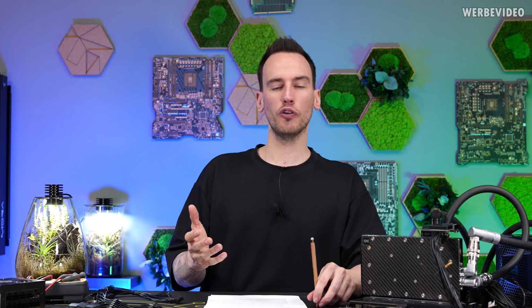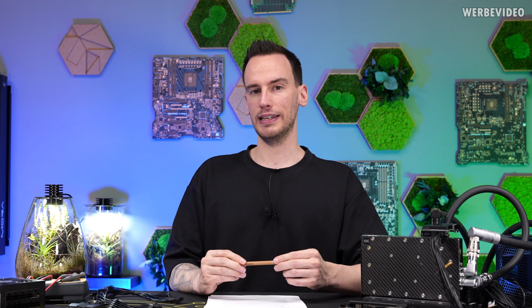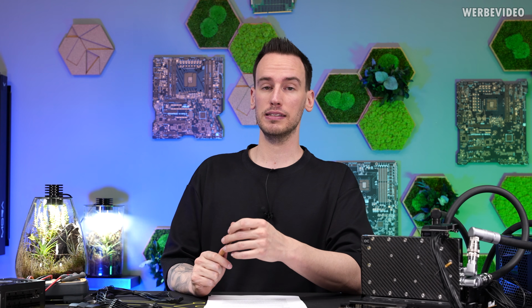In the first moment, all of this doesn't sound too concerning, but it kinda is. Because if we think of having 4.6 watts, that is not an enormous amount of heat, but for a connector it can be. But for me personally, what is actually more concerning is the contact resistance. Because if you look at the specification by Molex, if you look at the Mini-Fit connector and what the contact resistance max should be, they state it should be max 10 milliohms, and typically it would be a lot lower.